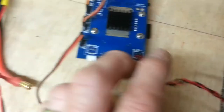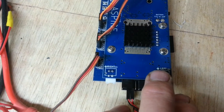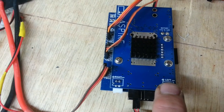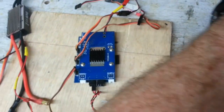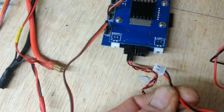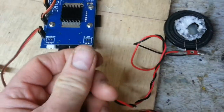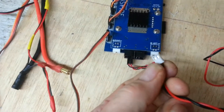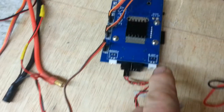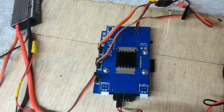Let's have a quick look at the TT25 hookup. The transducers hook up here - you've got right and left. You'll also see that polarity is marked on the board: positive and negative, slightly different to the V4.1 predecessor. Always watch out for the polarity on the board and make sure the TT25 plugs are the right way round. On the Aspire the plug only goes in one way; on the V4.1 it's possible to put it in the wrong way round. Earlier this year we had a small batch of TT25s with the wires inside the plug the wrong way round from our manufacturer - dead easy fix, just stick a pin down the hole and tease the wires out. Getting polarity wrong is critical - a bad TT25 can take down your board.